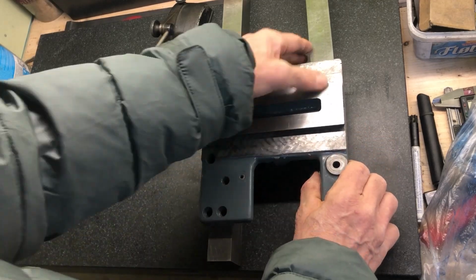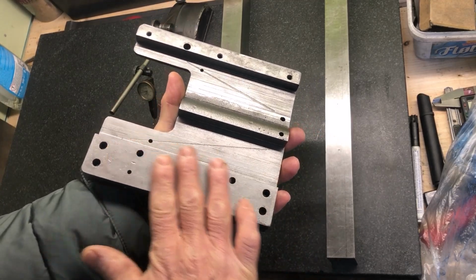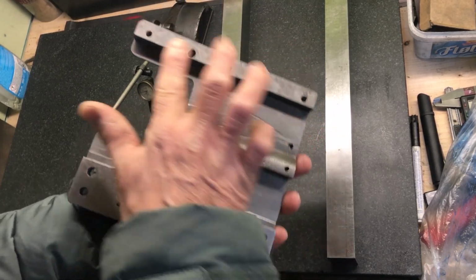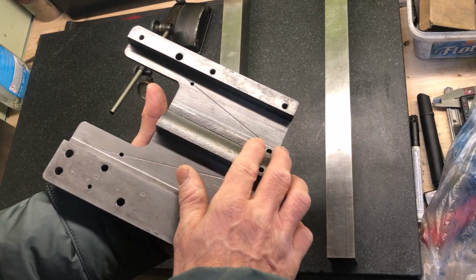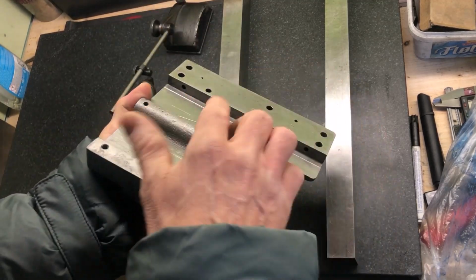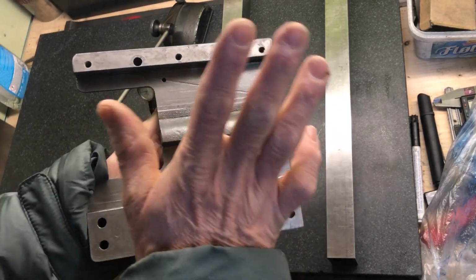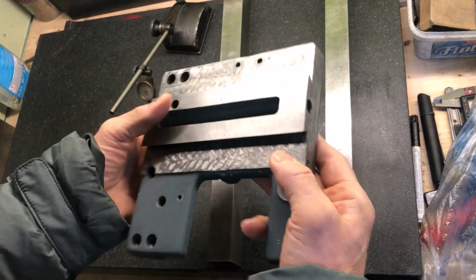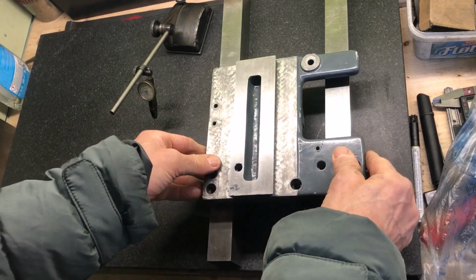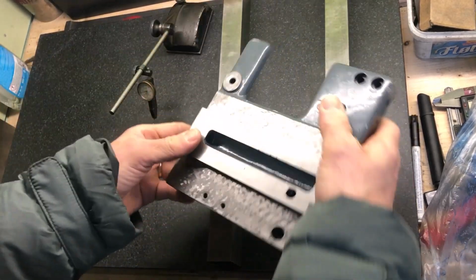So when I did this, I'm not sure if these are okay, but after some initial measurements, I saw that this was a little bit off here, but quite flat, and this was almost entirely flat. So I'm trying to establish then a correlation between the reference, which I know should be here, the unworn strip here. I will use this as a reference. This seems to correlate also to this surface here. And then, as I said, bridging across here, I have measured and then found the usual wear. I put it this way, I guess.